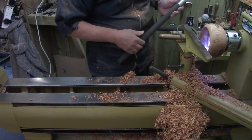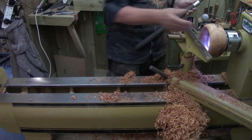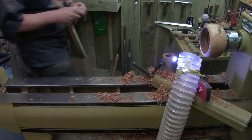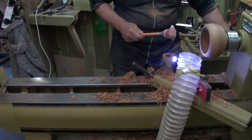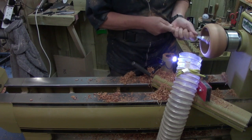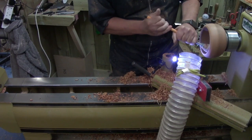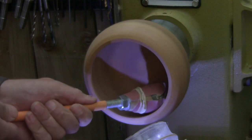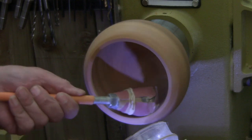So I can sand that out inside, and I can sand that edge on here as well. And that's basically the Pixie Fairy Bowl, the bowl part of it. Once it's sanded, there's a ball sander there. We're starting off with 120. Turn the speed down and just use a ball sander in here. You can make these quite easily. Just a piece of threaded bar with a ball on, about the 4 o'clock mark, there.